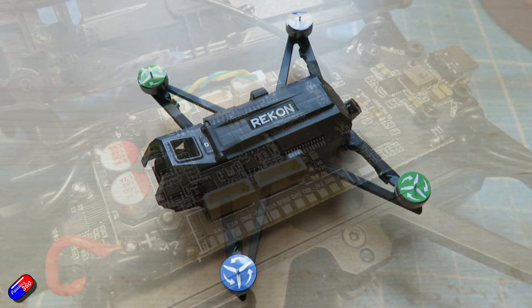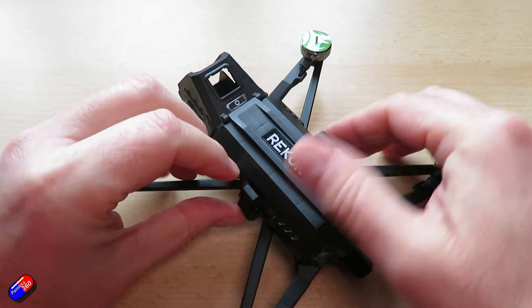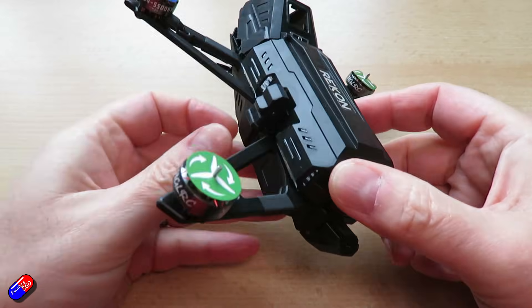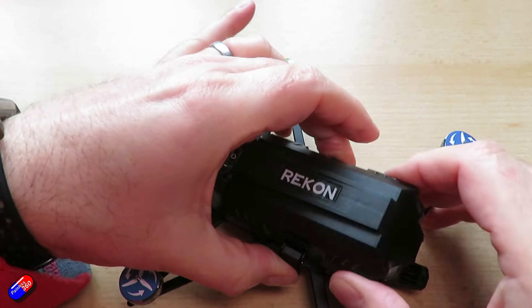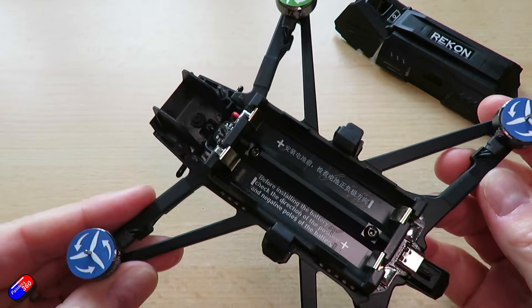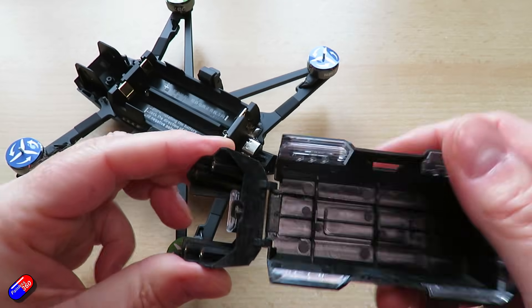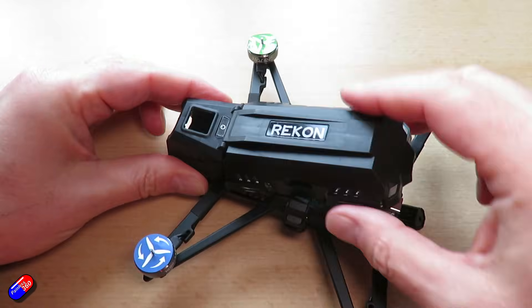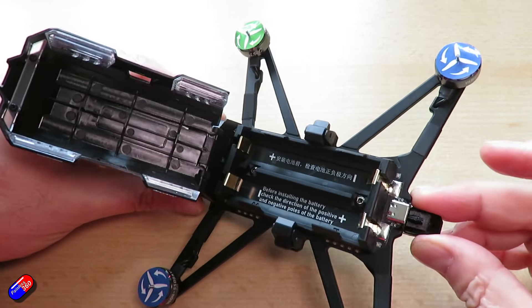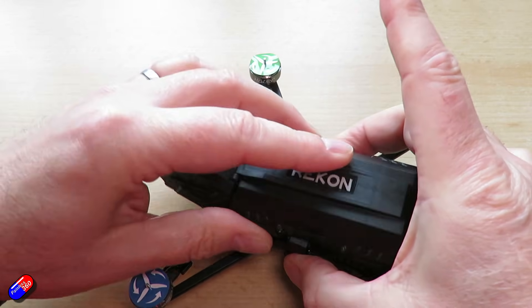Inside, the flight controller is an STM32 H743-based high-performance unit, so in-flight gyro and PID loops it handles without any stress at all. The body is injection-molded, very nicely finished, with parts for the GPS mount, camera mount, battery cover pivot, and the bottom cover that encloses your FPV system along with the heatsink. That heatsink will limit airflow, so I'm interested to see how that works in practice, since HDFPV systems tend to run a little hot. It does have a buzzer and customizable RGB light strips, so combined with GPS there's an excellent chance of recovering it if something goes wrong.